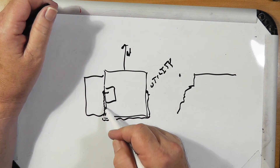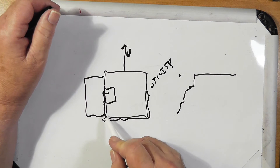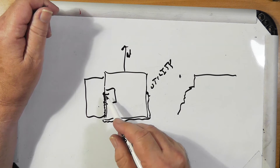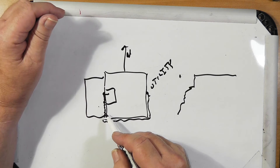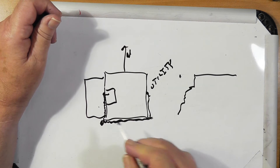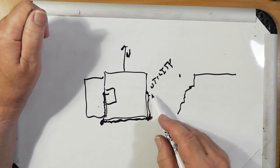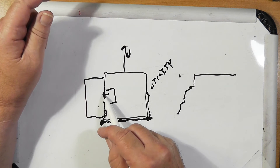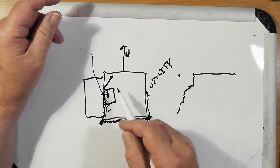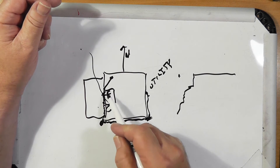Since you can't bury the bonding wire, you're going to have to attach or staple it right at the concrete and to the foundation — better if you can actually staple it to the ground within an inch or so of the house, then go underground here. I would put a ground rod here and a ground rod here and bond those — an electrician would be able to do that for you. Then you've got a good ground here for antennas that leave from here or go up on the roof. You've got your single-point grounding thingy here and everything in your shack is bonded to that.